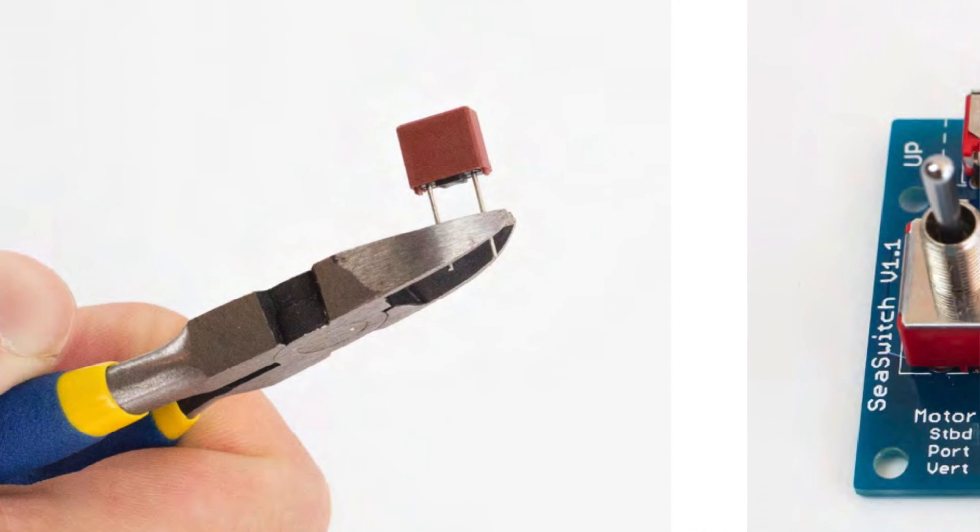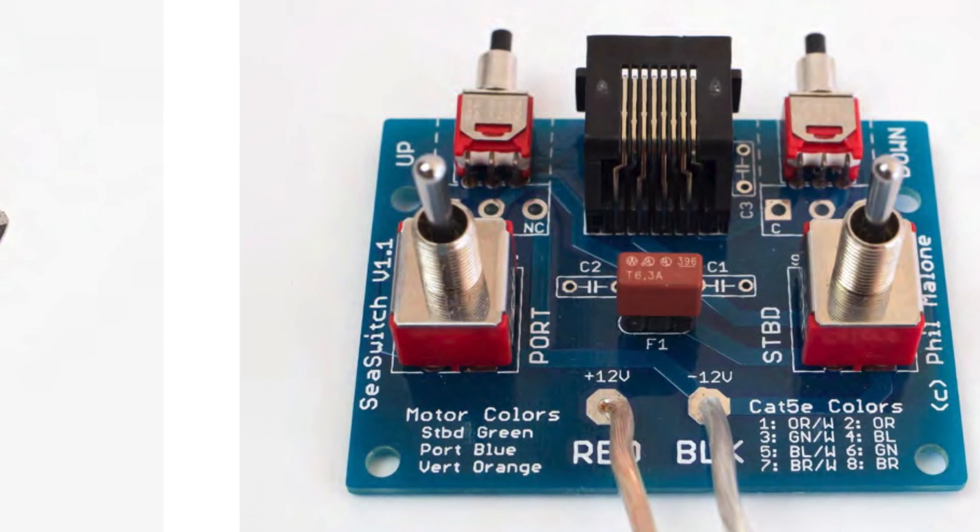Once the soldering is done, you can insert the fuse into its holder by trimming the fuse's terminals down to about a quarter of an inch and then inserting it. The final step is to bring the alligator clips onto the end of the 18 gauge wire. Split it apart about 6 inches, first using the wire cutters and then just pulling it apart the rest of the way. Strip between a quarter and a half of an inch of insulation off of both ends and twist the exposed wire. Slide the alligator clip insulators onto both ends, small hole first. The red one should go around the copper wire and the black one around the silver wire. Loosen the screws on your alligator clips — don't remove them. Slide the exposed wire up through the hole in the back of the alligator clip, wrap the exposed part around the screw, and tighten the screw. Now solder the wire and the screw together. Do this for both ends, and slide the insulators over the clips when they are cooled. That's all you'll want to do now before testing, so skip to the final section.